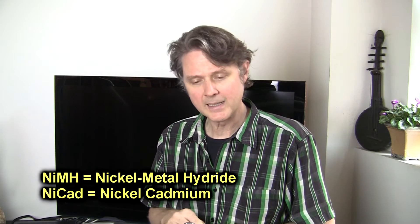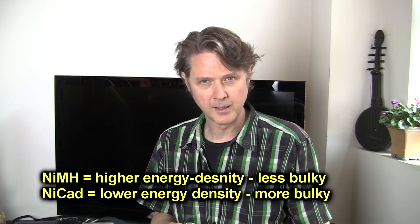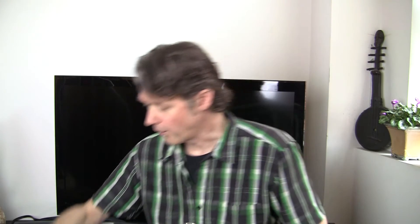I've got several batteries here including the IKEA ones, plus ENERSTAR 2200 milliamp hours and ENERGIZER 2300 milliamp hours. These particular batteries are nickel metal hydride — NiMH — not nickel cadmium. Nickel metal hydride is not as volatile as lithium. So you can use regular alkaline batteries or nickel metal hydride rechargeables.